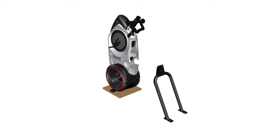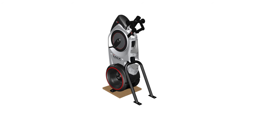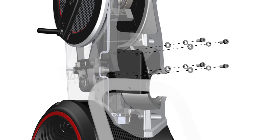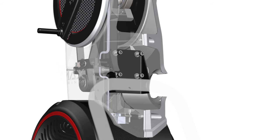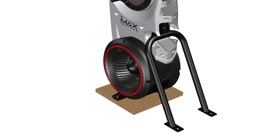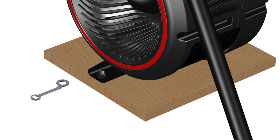Slowly push the rail assembly towards the frame and match the top holes as shown. Next, using 4 part A screws, 4 part B washers, and 4 part C washers, secure the rail assembly to the frame. Securely tighten each screw using your hand — only hand tighten the hardware at this time, as you will need to fully tighten it at a later step. Finally, using the provided 13mm double box wrench, release the frame from the shipping plate by removing the hardware located on each side of the frame.